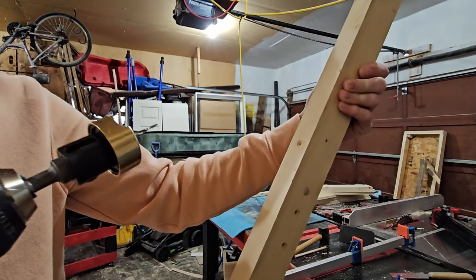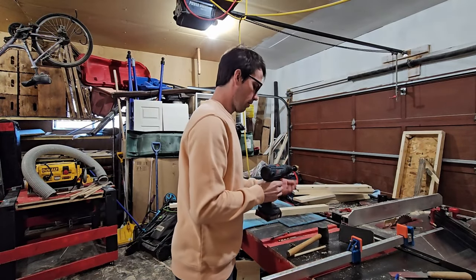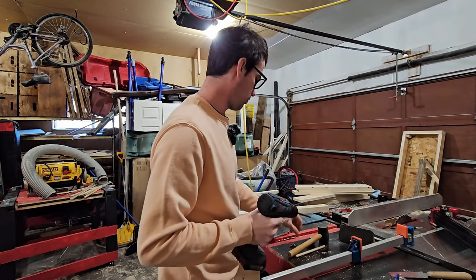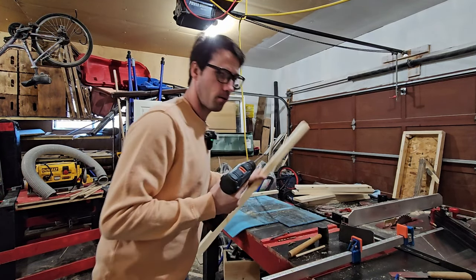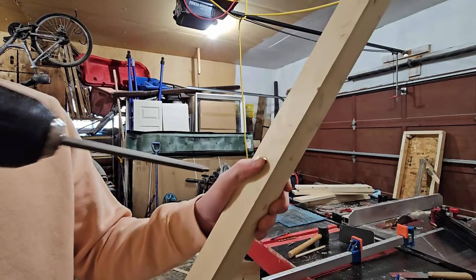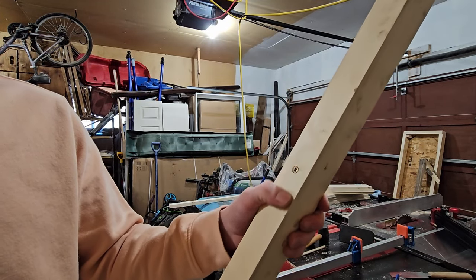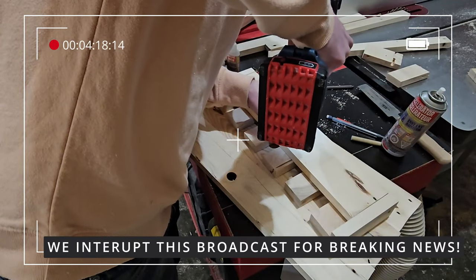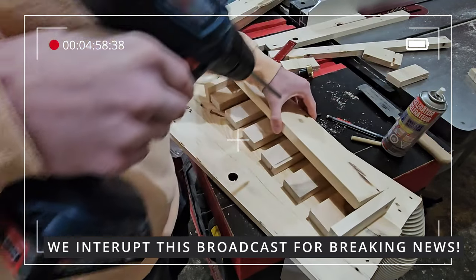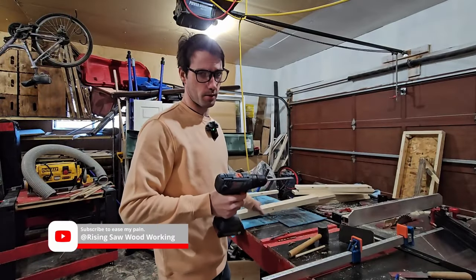As you can see I've drilled a nice little hole there with a little opening for our screw. Now switching to another bit, we are going to take the screw and place it into the hole. And just like that it has a nice opening, and there's almost no chance of the wood splitting.